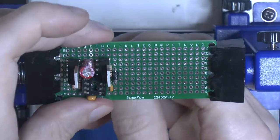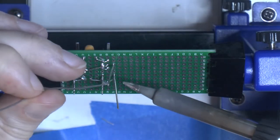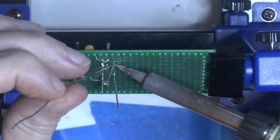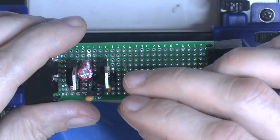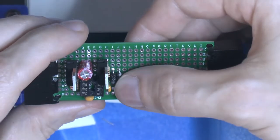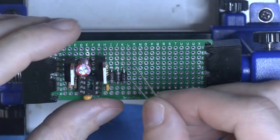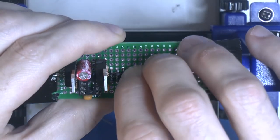This is the first of the four diodes — it's a 1N4007 diode. You can probably substitute that for something else, but that's what I had in my economy pack. I bought a bunch of different ones because it's nice to have those value packs. I think they were rated for like 175 degrees C — they do get a bit warm cramped in like that, but they're well within specs so it's not a problem.